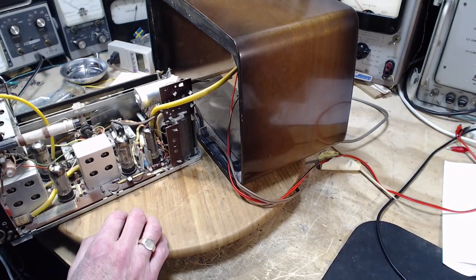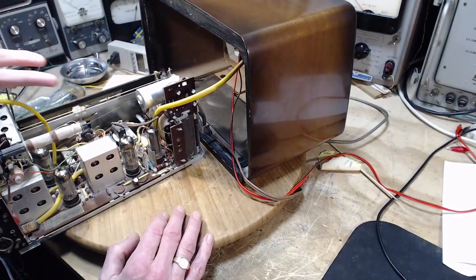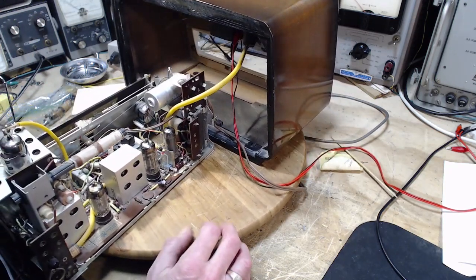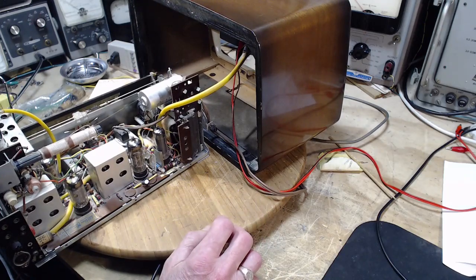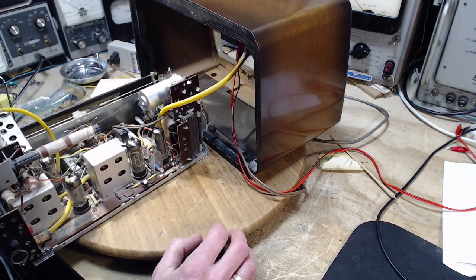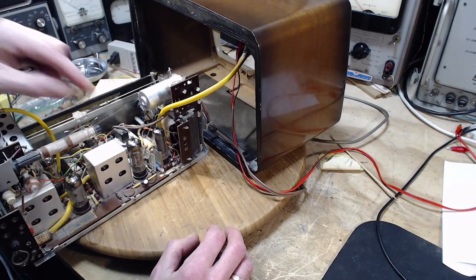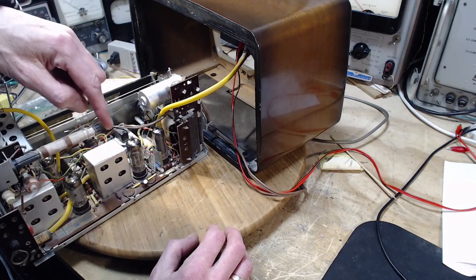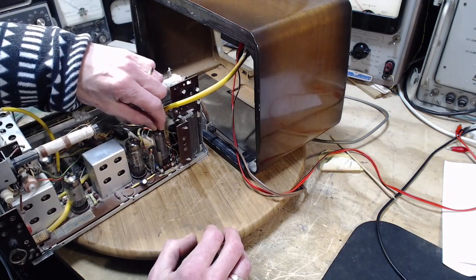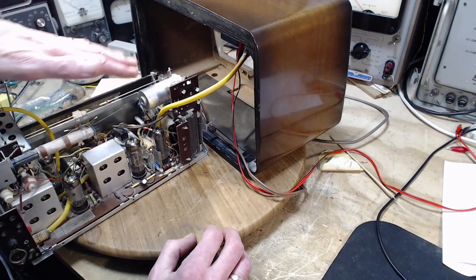So the way forward with this, one is, well, that's it, we're done. Two, there's some capacitors in here that should be replaced. Can that be involved in this issue? I ran this around in my head at the end of the last video and concluded that, yeah, if you really click your heels together 3 times really hard, you can see how maybe bad capacitors could cause an effect which would appear to be a defect in all the sockets. But really it's the radio becoming sensitive to normal sounds that would happen if you move the tube a little bit. And if I correct that sensitivity, then this noise will go away on all the tubes.